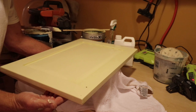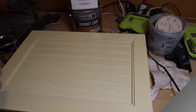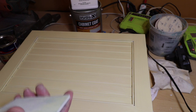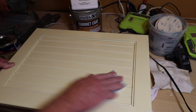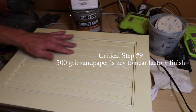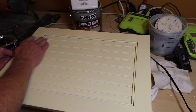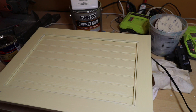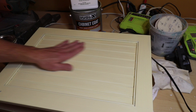Look how nice that looks. Wait until it dries — it's going to self-level even better. We talk about sanding with 220, but this is a 500 grit sandpaper. Not easy to get, unfortunately, but you could use anything around that range — you can even sand with cardboard. When you go over it, there's a big difference. This is smoother than this — this is factory finish smooth. If you go over it with something around 500 grit and just lightly go over it, it doesn't take a whole lot of sanding but it really makes a big difference. Then again, we're going to vacuum and tack cloth it and give it another coat of paint. That'll be the last time we have to sand this — this is as smooth as anything we'll possibly get.